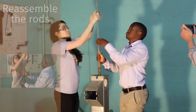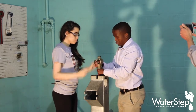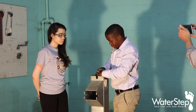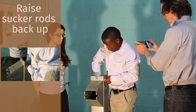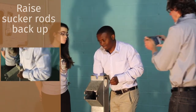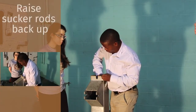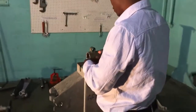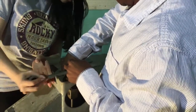The last sucker rod has the connection for our pivot pin. Lower it all the way down — you need to seat that bottom check valve because it may not have popped into place. Push it down into the cylinder at the very bottom of the well, keep pushing with a little force, and you'll feel it bottom out on that lower check valve. Bump it down and it locks into place. Then raise the sucker rod back up and put your wrench back through to hold it in position — slide the wrench through the two slots in the top of the pump head and let the sucker rod rest on that.